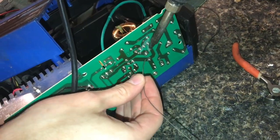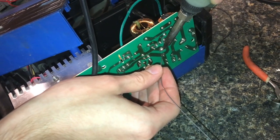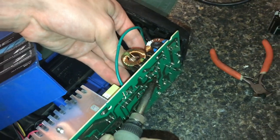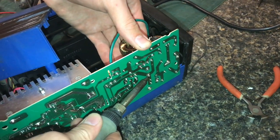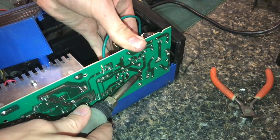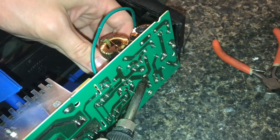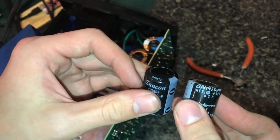I'm going to add a little solder — you may have noticed me do this on the other board too, especially on old solder joints. I find that adding a little fresh solder helps the heat flow better. I can put some downward pressure on this, but not too much at first because the capacitor is sitting flat against the circuit board and won't want to wiggle much until it's actually off the board some. Okay, that pin just dropped out. A puffed-up top on an electrolytic capacitor is a sure sign of failure.